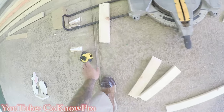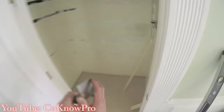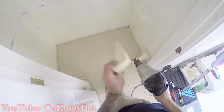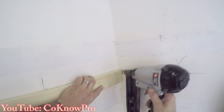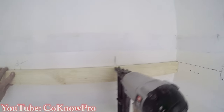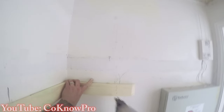This is the compound miter chop saw we're using. Like I always say in all the videos — use protection, guys and girls, please. Be safe while you're doing all these projects. If you feel like this is a project you can't do, please hire a professional licensed contractor, because remember: if the job equals more than five hundred dollars labor and material combined, you need a licensed contractor. Here's the ledger — I'm setting my finished side in because that looks the nicest. My rough side faces the wall and my finished pine side faces in. Now I'm nailing it with two-and-a-half-inch 16-gauge brad nails into all the studs I pre-marked on my layout.